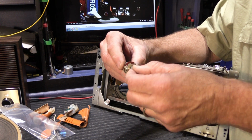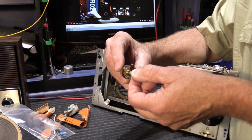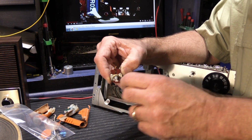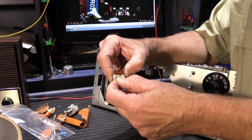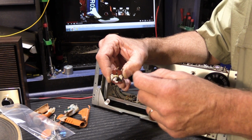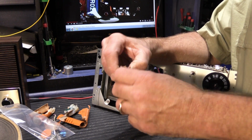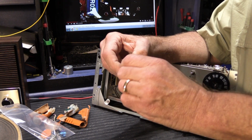I suppose I could take it apart and take a look since it's kind of shot at this point. But the problem with this one is if you turn it lower than maximum volume, as soon as you go off maximum volume just a little bit, the sound cuts out and you don't get any lower volume than that. So it's not really working as a volume control.